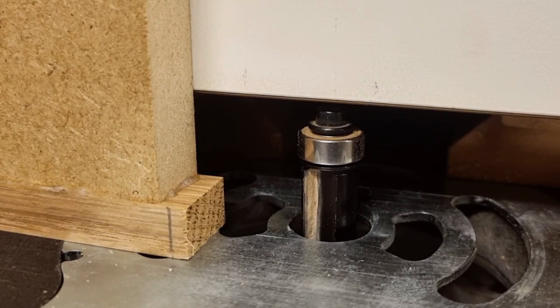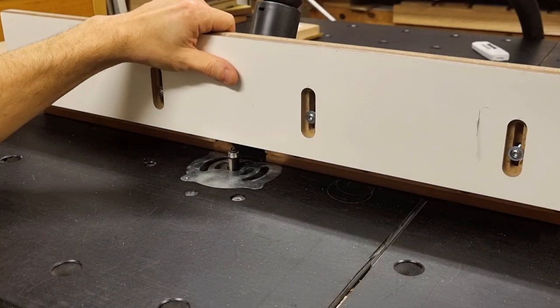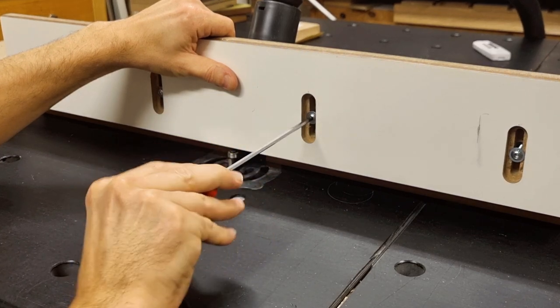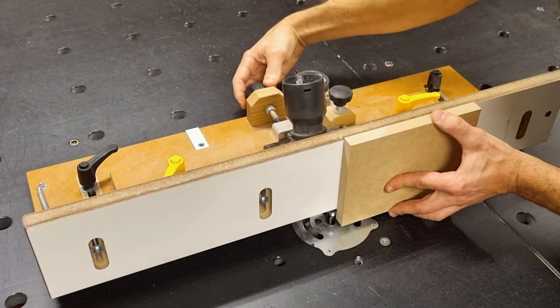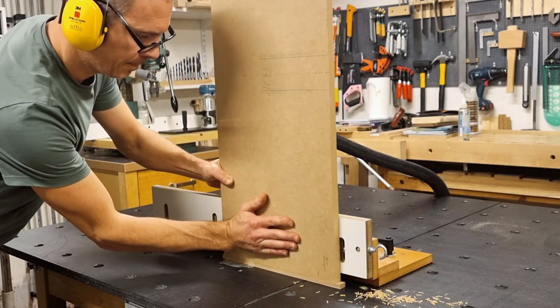At the router table I install a bearing-guided bit and set it at the height so it will trim the edge banding plus a little bit more, taking the glue squeeze-out as well. I adjust the curtain-style router table fence so the bit just passes it, then use a flat test piece to set the fence so it just touches the bearing. Here I'm routing in the wrong direction — a so-called climb cut — to avoid tear-out and get a better finish. This climb-cutting technique can be dangerous if you're not prepared; the workpiece wants to pull away from you. I only use it when routing away a very small section of wood. Using the router table this way is my preferred solution — it's quick to set up, quick to run the parts, and gives consistent results.